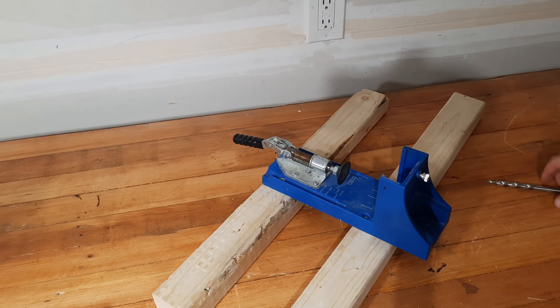That's why I like to do a little test piece first. Now I have my square drive screwdriver bit in my drill, set to the screw function with the clutch set to 12. You will have to change that depending on the wood you're drilling into — if it's hardwood you'll want it set higher; if it's soft like this, set it lower. You can get the screw pre-started before putting your wood together, but all I like to do is hold it over like that and then screw it in.